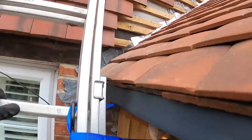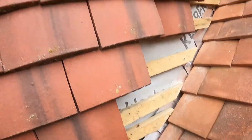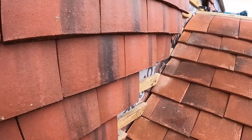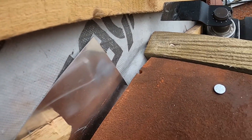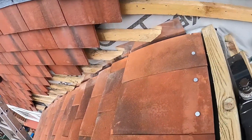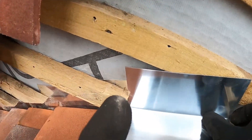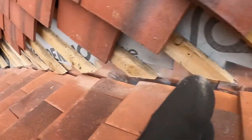If you've got no scaffold, I'll show you here. You need to put flashing on or under every tile. You put it down at the bottom of the batten. Imagine this is your next row — you put your flashing and if possible tuck it behind the batten. That will make it easier for you to hang these tiles.